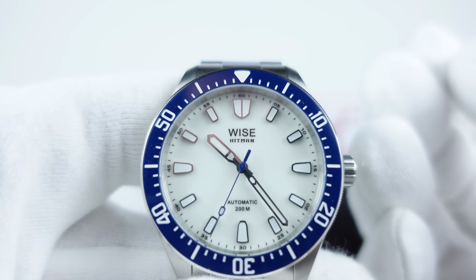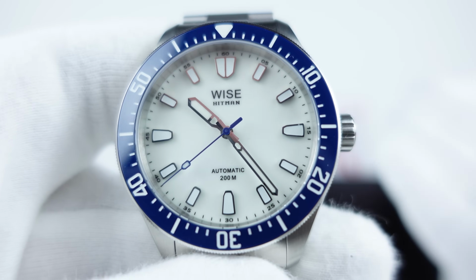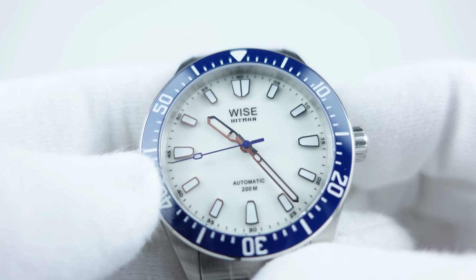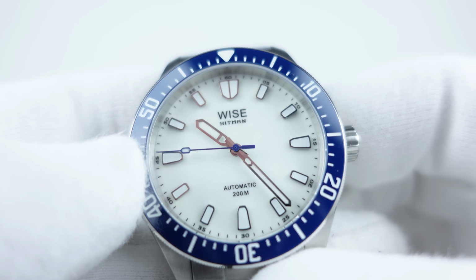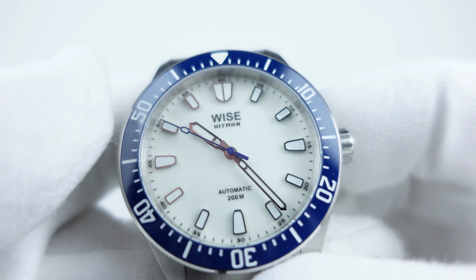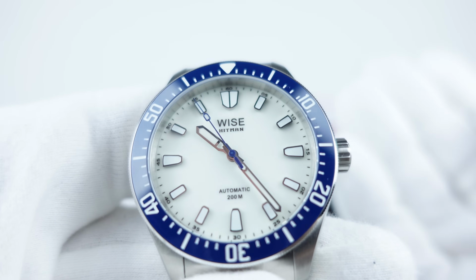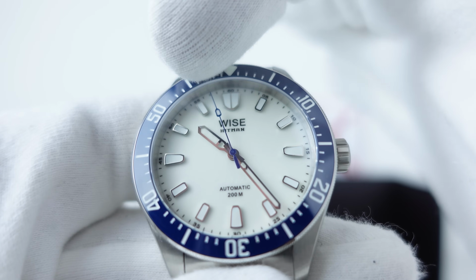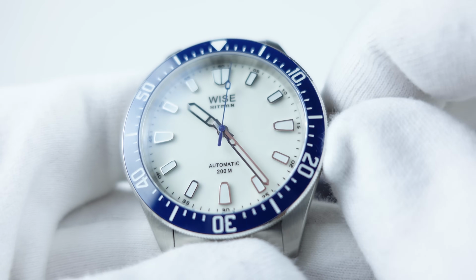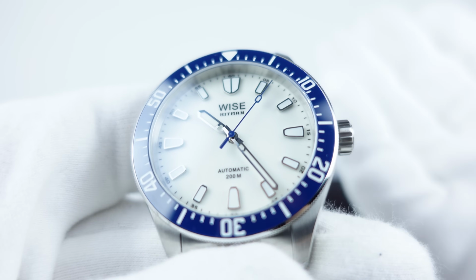It's reliable, well proven, it's a good, robust workhorse caliber made in Japan by Seiko. Subjectively, the only negative is that the second-hand stutters or judders, as I've detailed, because that's a characteristic of movements running at 3 Hz and 21,600 vibrations per hour. I prefer a 4 Hz sweep because it's smoother, but this is subjective. For the majority of collectors, a stutter or judder of the second-hand at 3 Hz isn't a negative, it's not detrimental. Manual winding works well, hacking works well, and I like that it hasn't got a phantom date setting position.